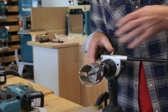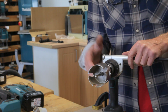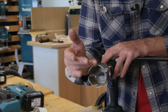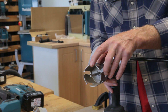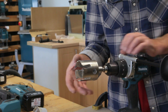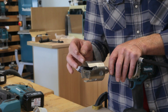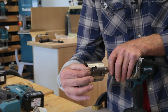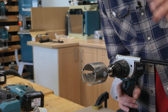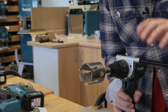You can use these on brickwork, you can use them on Thermalite, and all kinds of different materials. But once you've done that, they're never going to be as sharp as when you first get them out. If you continue to use them on board materials and wood you'll get a lot longer life than if you go hacking through Thermalite. You can give them a little sharpen with a green grit wheel or a diamond to bring them back to life, but don't ever expect them to be as good as the day you get them out of the box.